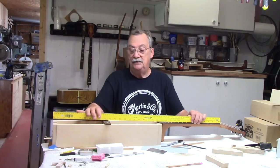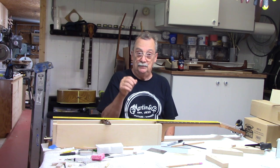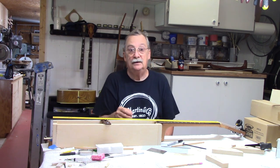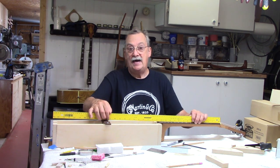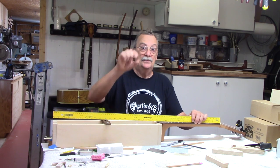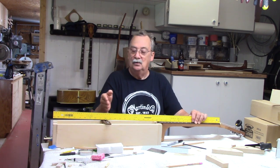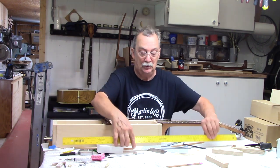You can move it a little bit forward or back depending on the guitar you're building. A finger picker's action will be different than a flat picker's. If you move that twenty-five and a half to the front of the saddle slot, that actually places it back a little bit further. The higher the action that you need for a flat picker, you kind of want to play it to the middle or forward into the slot. And that's what this little jig will do.